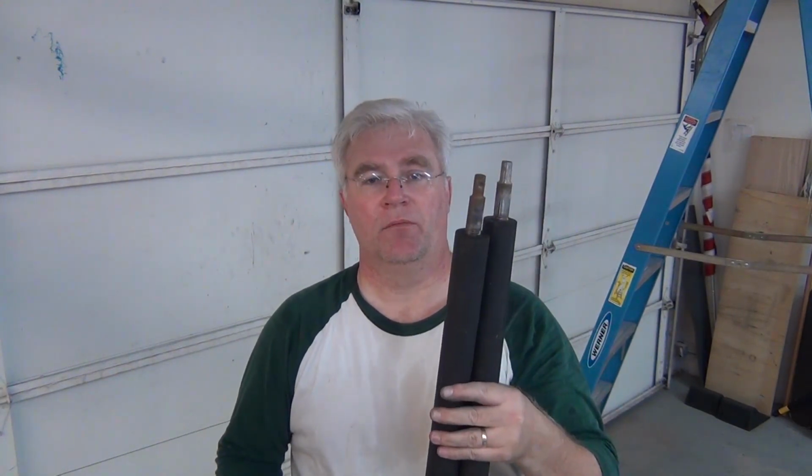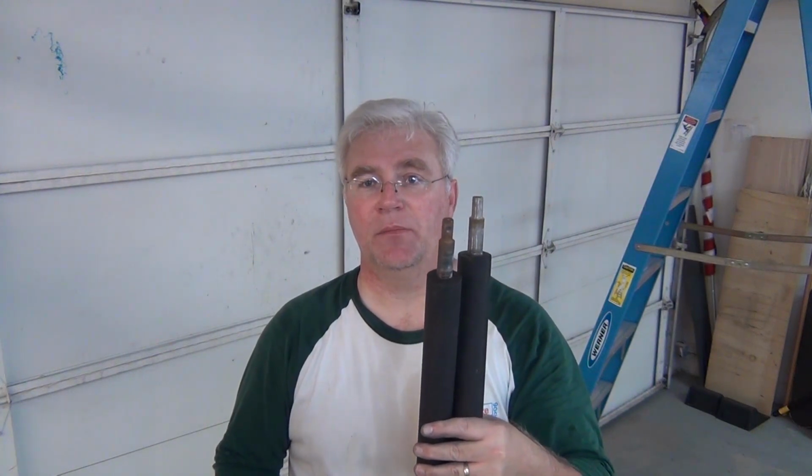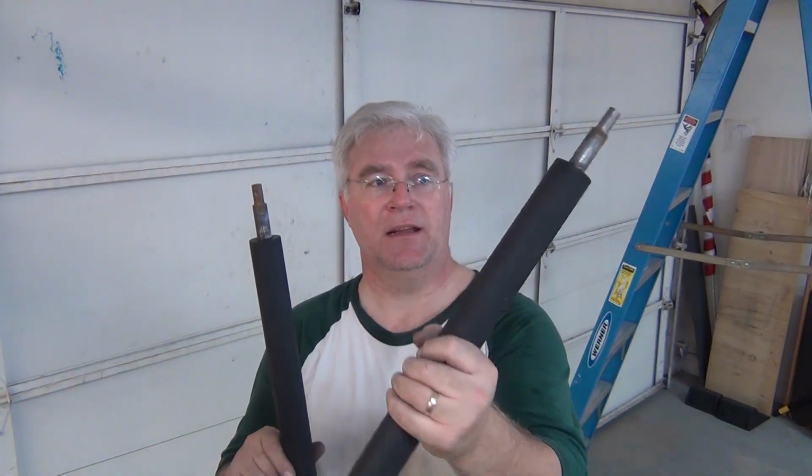Okay, before I get up on the ladder and start doing one side, I make sure I have my tools with me because you can't stop. Once you start, you either finish the job or you have to rest with the load on your shoulders and back it all the way off again. This is the dangerous part. This is where people kill themselves. They don't use the right tools, or they get too tired. Because you're going to have all that energy loaded up in these bars going across your shoulders. So have your bars ready, really strong. You don't want these bending. These are pretty darn stiff rollers.